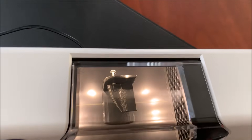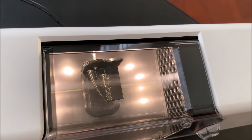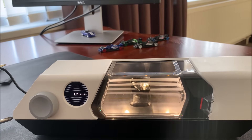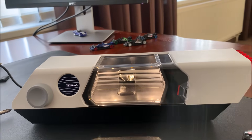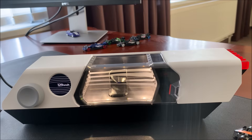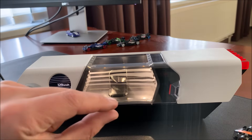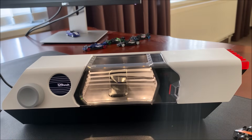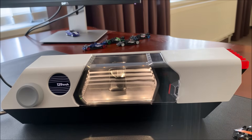We can also see it from the top — it's a pretty nice clean flow, not really pushing the streamlines much at all. But here closer to the end plate we can clearly see how we push the streamlines further up. We push them apart in the middle, which means it creates downforce. In the middle the flow is relatively undisturbed, and at the tip we can see that it's not affecting the flow very much — which is exactly what we want. So we don't have this tip vortex.